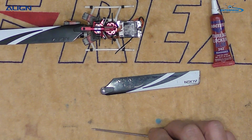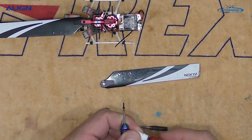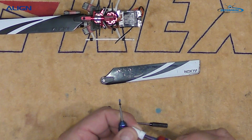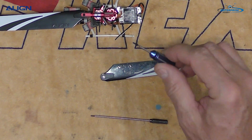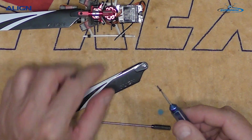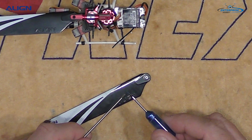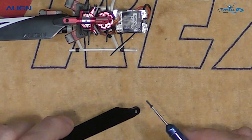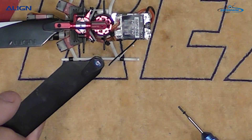So you need to be very careful of this. What's happening is that people are applying too much Loctite to the screw because they're going to secure the screw in place to the head itself. When the screw goes through, the Loctite, as you're threading in the backside of the blade grip, is going to travel up the screw, placing Loctite a little bit into the root area — as you can see right here.